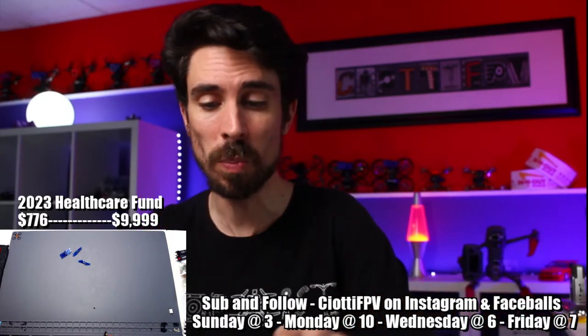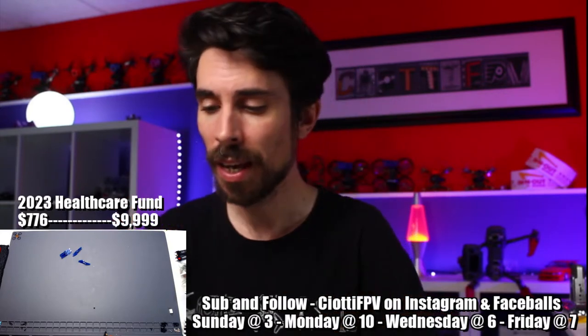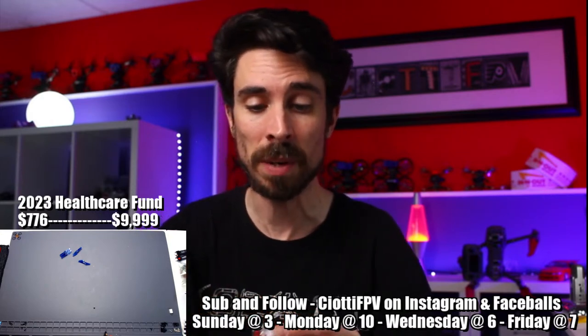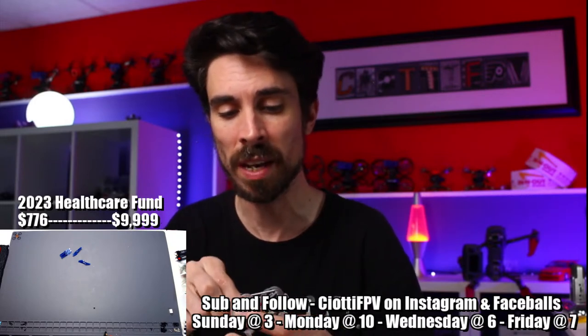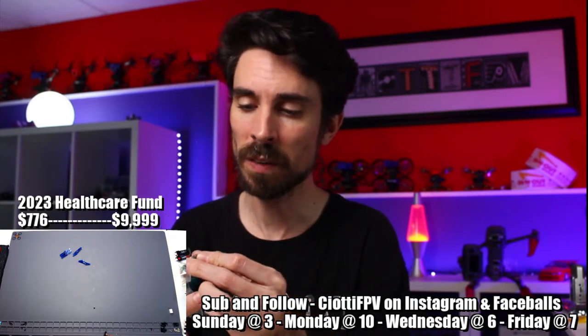Motor weight is super important because it's all the way out on the ends of the arms here. So swapping over to these motors should have a pretty significant effect that maybe I'll actually be able to feel. Maybe not. Maybe I'll just be able to feel a difference in power from the additional KV, but there's a chance I'll be able to feel the difference in weight.